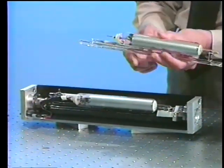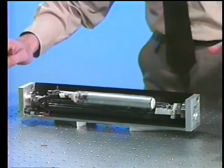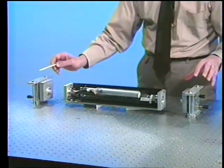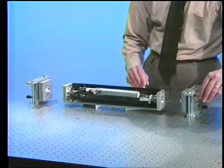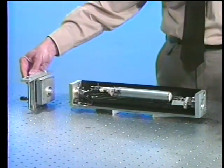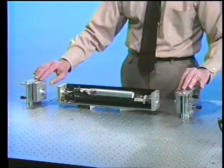So here is the amplifier tube inside this laser. Let me now point to the mirrors. Here is one mirror, and here is the other mirror. Each mirror is held in a hefty mirror mount, and the adjustments are over here — we have two adjustments on each side. So here is the tube, the amplifier tube, with windows terminated at Brewster's angle, and then the two mirrors.